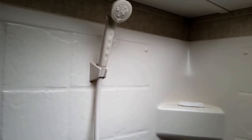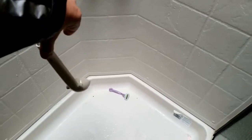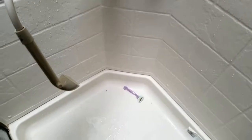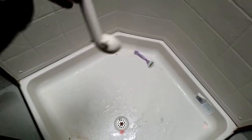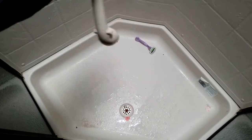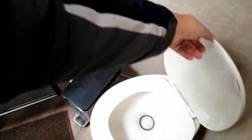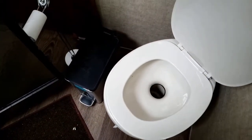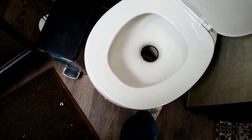I'm just going to get this down to make sure we get all the water out. I'm going to open up the cold and then close the hot — now we're blowing out the cold. Looks pretty good. Now I'm going to do the toilet — close off the shower — and you can see the water being blown out.